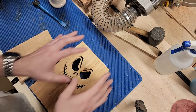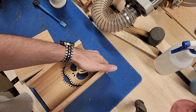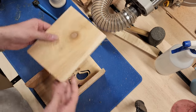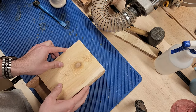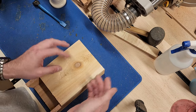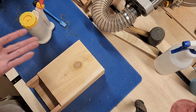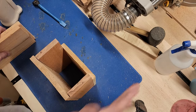Hold it together while the glue dries, and you can continue working as it sets. Now you've got to get the back piece. Once you have this pretty much glued and set, take your back piece which is shorter. Line it up nice and even at the top. Same thing — get the glue on each side, put this down and nail it in.